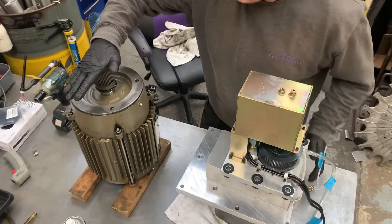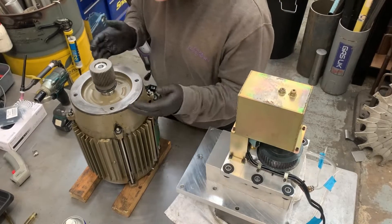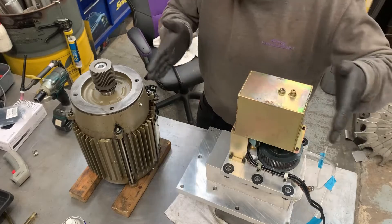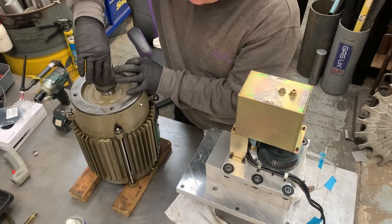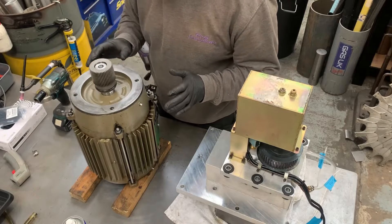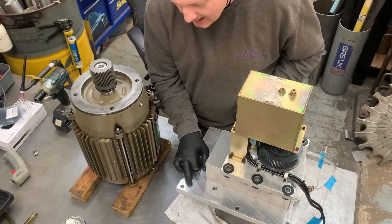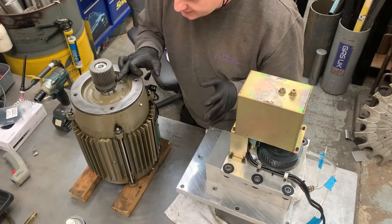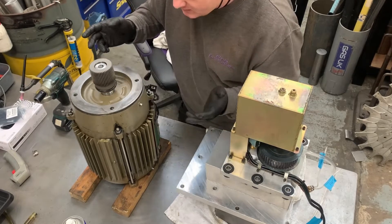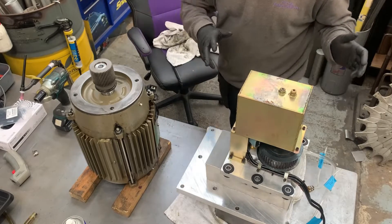What we need to do now is lift this whole plate on top of the motor. I had to look back at one of the previous videos and I've marked the front of the motor, because obviously there are three bolt holes and you could orientate that wrong. So I found which is the front bolt. I need to lift this up here, put it on nice and square with the weight over this pulley, and then we can drop one of the bolts in so it takes the weight because it won't tip itself over. Also as mentioned, this O-ring doesn't actually touch the bore on this plate - it may just be to stop some oil splash, because it wouldn't want to seal properly as it would be spinning in the O-ring and eventually get hot and melt.